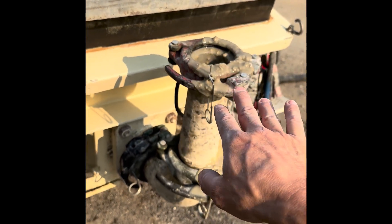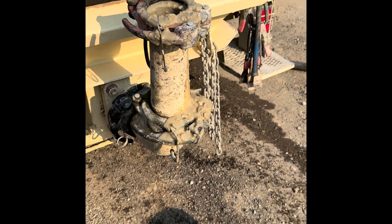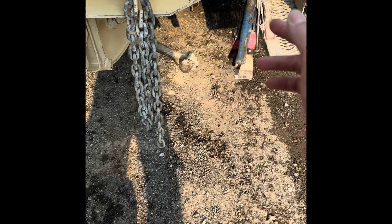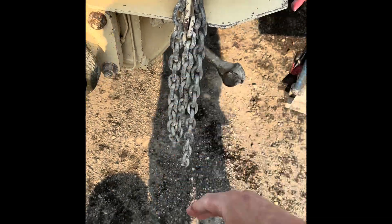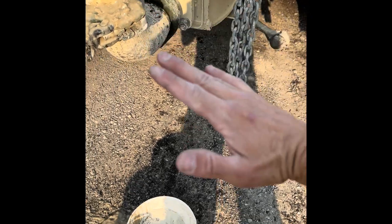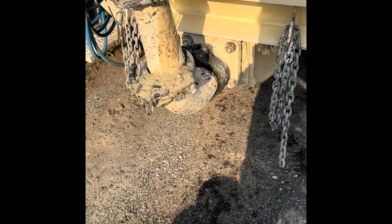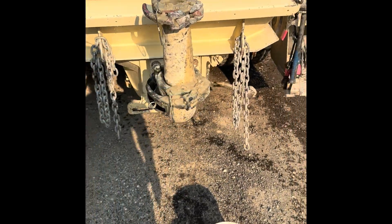So once that bentonite is in there, no stroking of the pump. If you stroke the pump, it's all gonna fall out of the S-tube and back into the hopper, which is not good. So what I'm gonna do, I'm gonna put my reducer on. I tilt it down but still keep it slightly vertical and I'll hold it with these chains. Hook the hose up. First couple strokes with the reducer still on a slight vertical plane will keep that primer from running ahead of the concrete and down into the hose. Once I get a couple strokes through the reducer assembly and into the line, I'll loosen the chain and drop the reducer back down. We have these chains because they're required by the ready mix outfits now - we've got to chain up our reducers on the back end. In the event that the elbow blows off, the chain keeps it from hitting the driver on the knees.